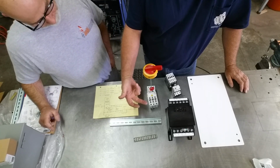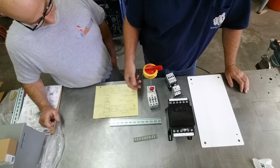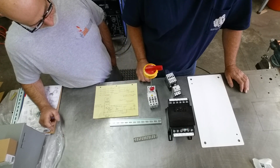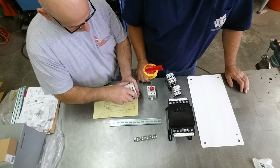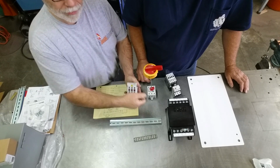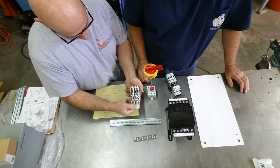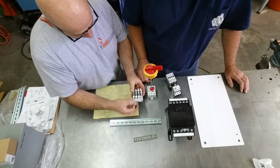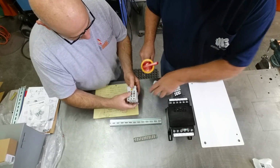So that's a pretty neat fuse setup. On the pull-out tray, the fuses become safe when you pull them out. They disconnect top and bottom when you pull out the tray, and it mounts right to the main disconnect. Yeah, this thing's pretty cool actually. Who hasn't struggled trying to pull a damn fuse out? But you just roll these out, and then you can slide them out of the holders, so it strips them out of the clamps. And what's the manufacturer on this?